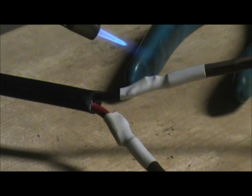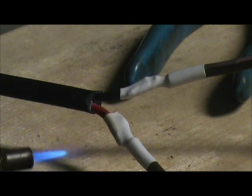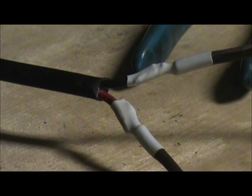It'll take a lot of heat. See how it just pulls up tight on the wire? All it takes is a little heat — kind of work it around here and there. I do tape over the top of it just to lock it down good, because I believe in a lot of redundancy in marine electric. So there it is folks — easy to do and 100% solid.